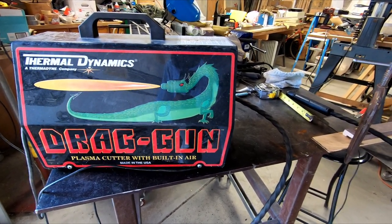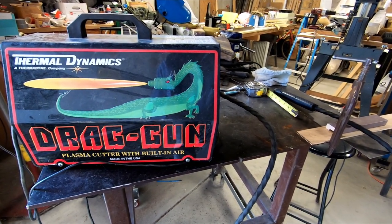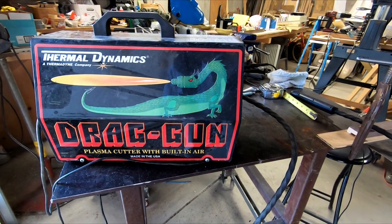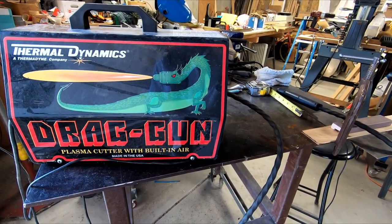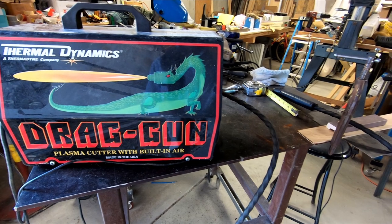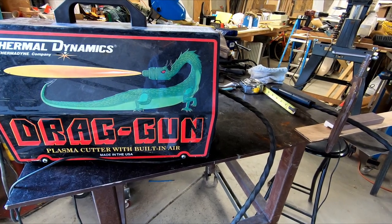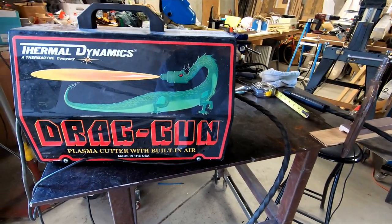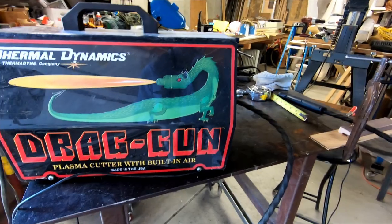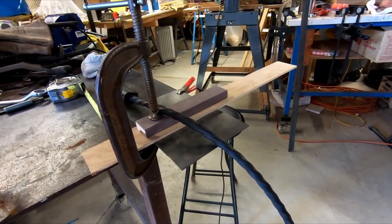Plasma is a gas which has been heated to an extremely high temperature and ionized so that it becomes electrically conductive — and as you can tell, I'm reading this; I wanted to get it right. The plasma arc cutting process uses this plasma to transfer an electrical arc to the work piece. The metal to be cut is melted away by the heat of the arc and then blown away. There is a little air compressor in there as well that helps with the blowing away process. That's enough technical — you'll see sparks flying, and that's the fun part.